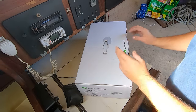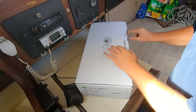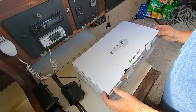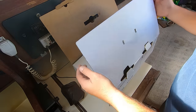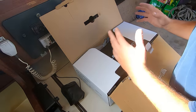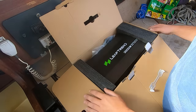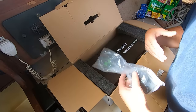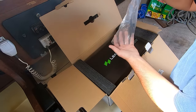All of our boats have batteries in them — 12 volt, 24 volt, whatever it is — but for some of our needs we need 110 volts to plug in the laptop, things like that. A power inverter becomes a necessary evil, but power inverters run at about 20% inefficiency. So we lose 20% of our hard-earned power from our batteries every time we invert it to 110.